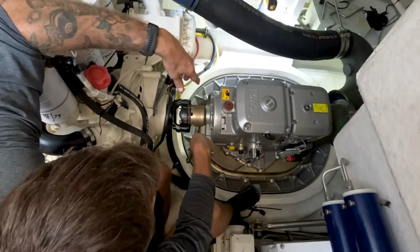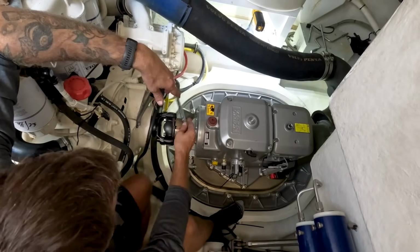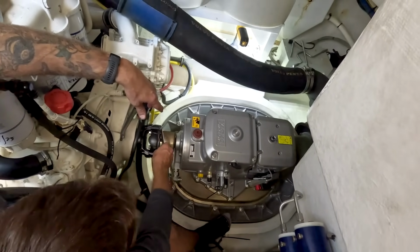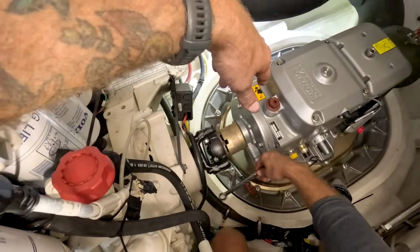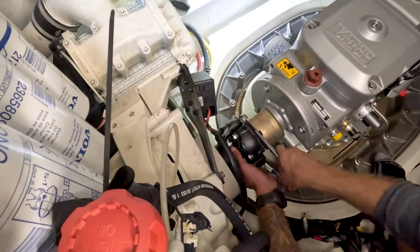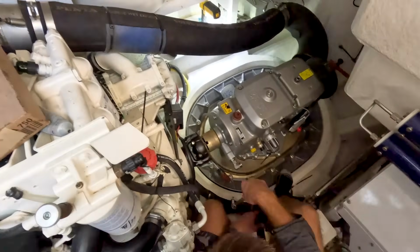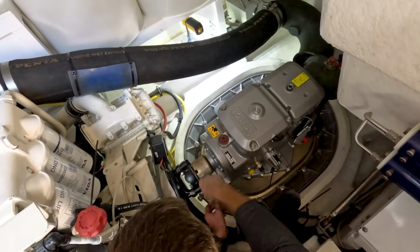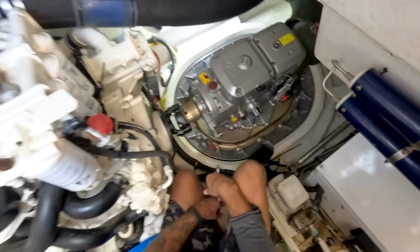As far as drive units go, getting this apart is probably easier than any drive line I've ever done. It's literally these 4 bolts come out, and this whole U-joint, not only can it pivot, it will slide back and drop down. Once it's disconnected, there's so much play. It'll slide back a couple inches, and go up, down, left, right. Very easy for adjustment. All the keyways just line right back up, and then you slowly tighten them back down into place so they're not binding, for a nice flush fit.